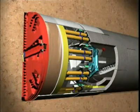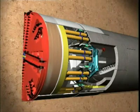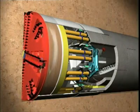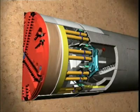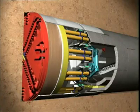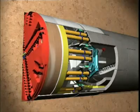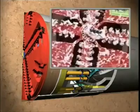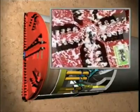In contrast to the bentonite shield, in the case of the EPB shield the excavated soil itself acts as a supporting medium. To fulfill this function it must first be turned into a plastified consistency. Depending on local conditions, this is done by the controlled injection of conditioning agents such as foam, which makes it possible to reduce the drive torque and cut down wear. The foam is injected into the soil ahead via nozzles installed on the cutting wheel.